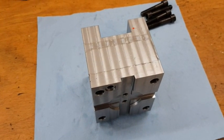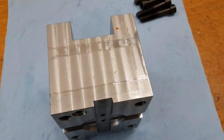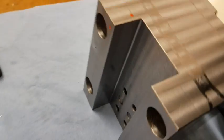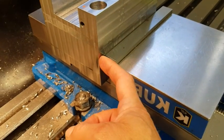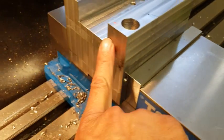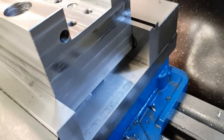Only one thing left and that is to drill the coolant passages. There's the intake, about 50 millimeters deep. The first hole avoids the mounting holes barely. Then there's a hole that goes all the way through, exiting on that side. And then there's a hole that will intersect both of those. The coolant channel comes in there — I drilled the hole all the way up and tapped it for M8 so we can plug it. Drilled here, tapped M8, drilled halfway, and then drilled the other way halfway to meet the hole — which it did.